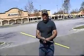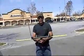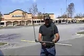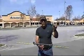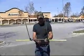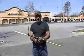Hi, I'm Joe of KA-4WJV. I have a direction-finding antenna. This is a 2-meter antenna — two quarter-wave verticals, one quarter-wave apart, and it has a sharp null pattern.